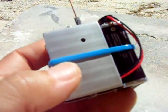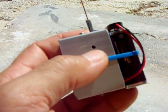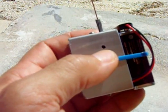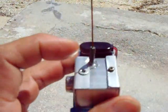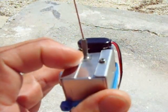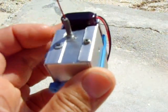Right there, that hole is for putting in the little plastic screwdriver for the trimmer capacitor and you can adjust the frequencies from 80 to 150 megahertz. I put a little piece of spline from screening and I put the wire through the spline — this way it doesn't touch the side of the aluminum to short the antenna out.